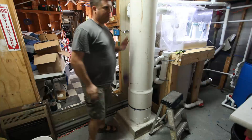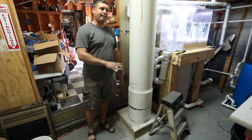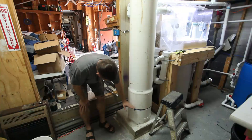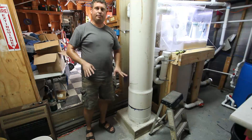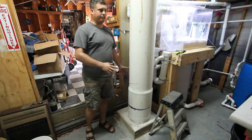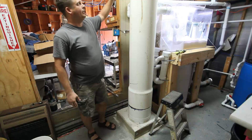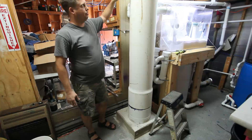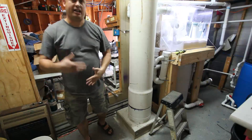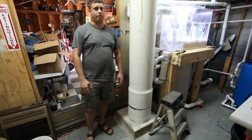Now, a 12 inch piece of pipe is not like a 3 or 4 inch piece of pipe — it's going to take a few days to get a good hard seal. The cement in this joint is going to take some time to cure, so I'm going to leave it alone for two or three days. The next step is to either install a coupling or transition from here down to 10 inches. Thanks for watching and I hope you have enjoyed the video — I look forward to you watching part two.